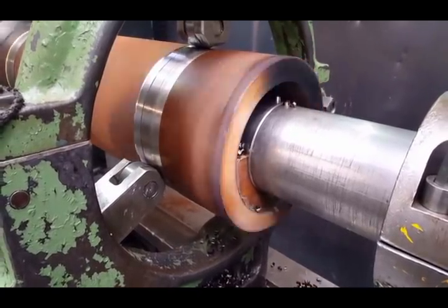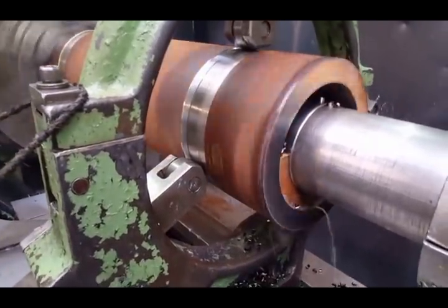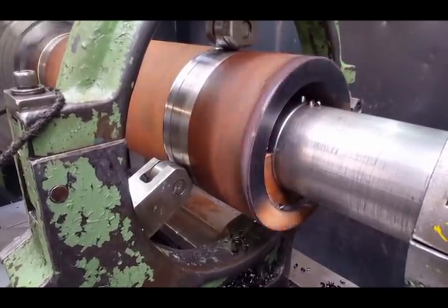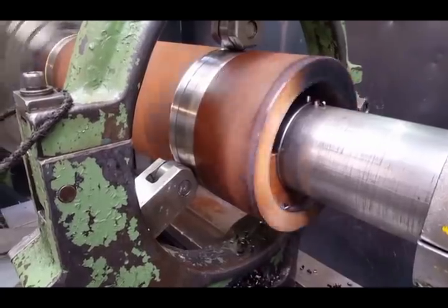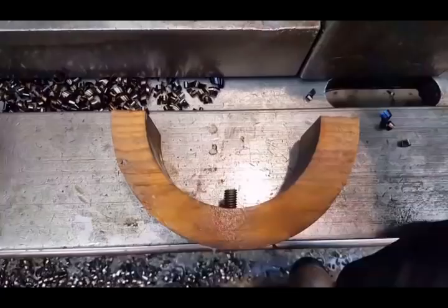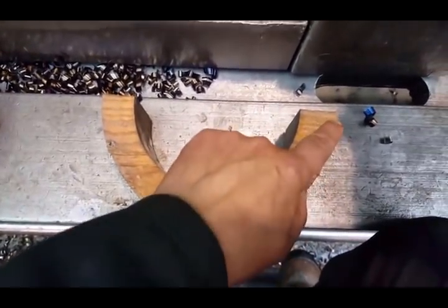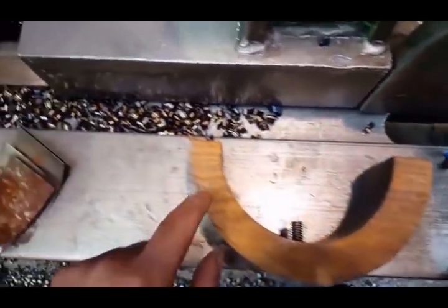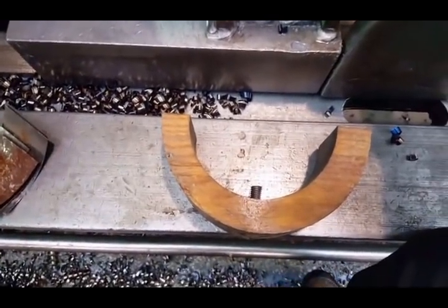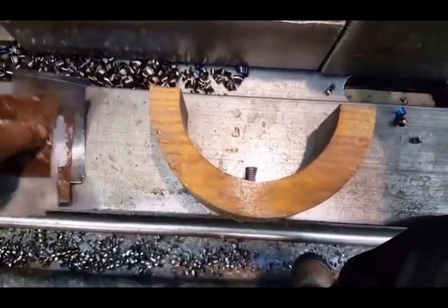It's wearing out on the right-hand side. I'm going to finish this job, and then I'm going to run the clock along the boring bar just to see how far out it is. I hope you're following so far. Can you see the difference in how the wood's worn — that thickness to that thickness on the opposite side? I've done 22 of these jobs. Every time I have to shim the wood out on this side.